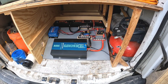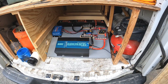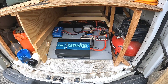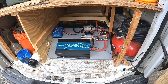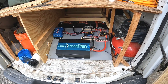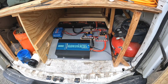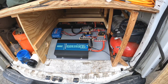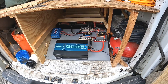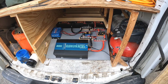I've got some half-inch foam board insulation in between them to cushion them, so they're nice and packed in tight. Right now the other two batteries — one on either side — are fully charged because they went in first, of course. The third battery is the one in the middle. I need to get it charged up to within one tenth of one volt of the other two, and then I'll rewire them all together in parallel. I'll be showing you how we do that in the next few days.